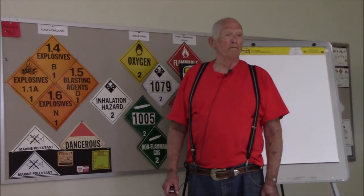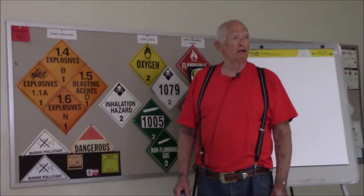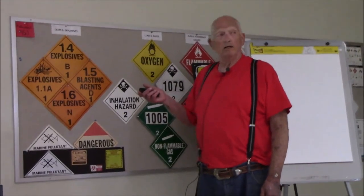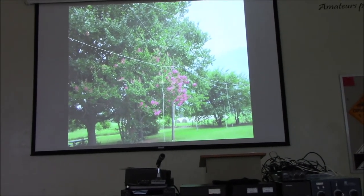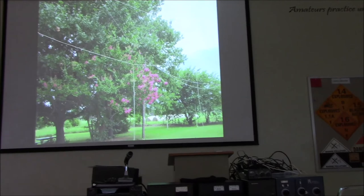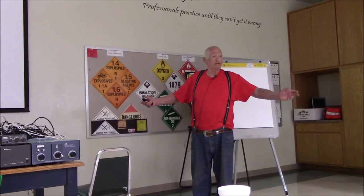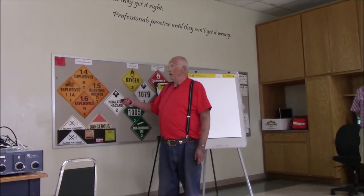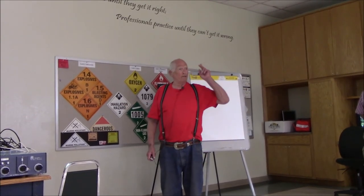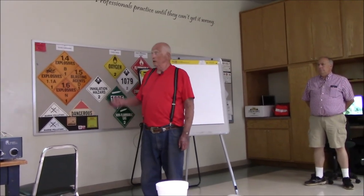How do you evaluate an antenna for whether or not you're going to use it? The reason I was interested in these antennas was because they're physically small. In other words, a half-wave wire antenna for 40 meters without traps in it is 66 feet. It's 33 feet for 20 meters. It's 135 feet for 80 meters. It's 240 feet for 160 meters, this sort of thing, 270 feet, whatever it is. Well, and a vertical for 40 meters, 33 feet, plus I got a loading coil. And even 30 feet for 10 megacycles, and that thing is 8 feet high.